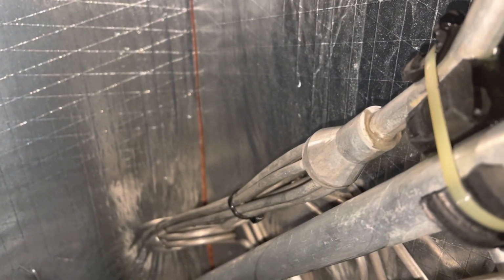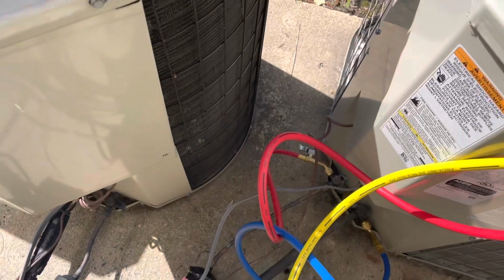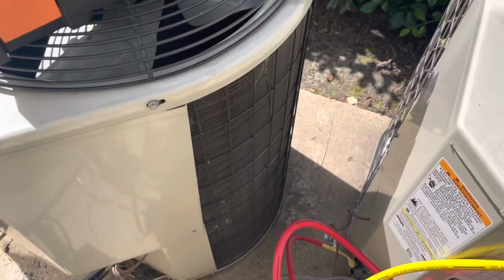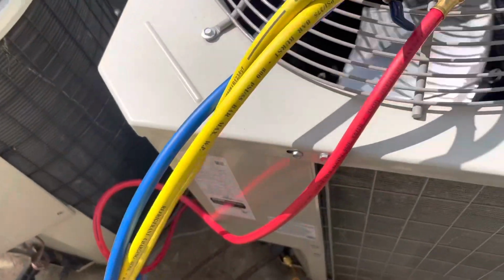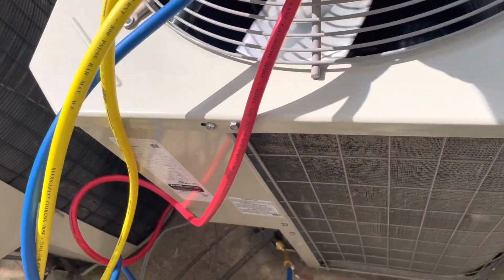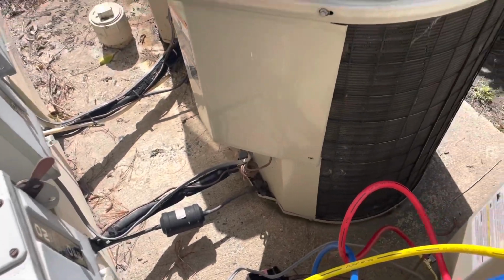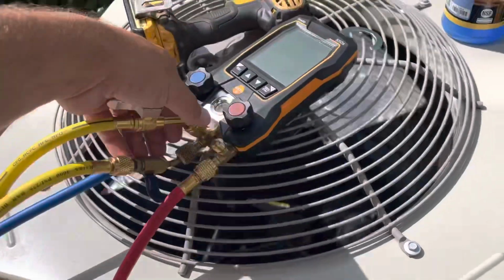All right, I've checked just about everything with the electronic leak detector, and surprisingly enough, those shark bite fittings up there are not leaking. I've tested them with the electronic and I've tested them with bubbles. I've checked everything out here too. Hopefully it's not in the wall, because then he's got a pretty big issue there. We're on a 3rd floor apartment here.